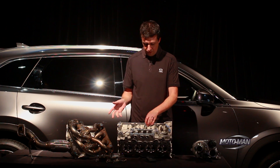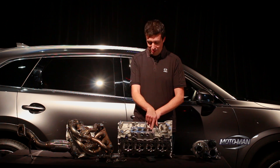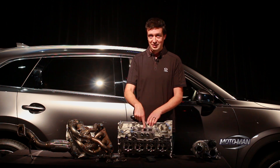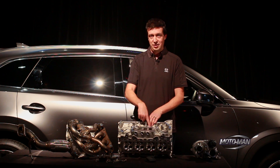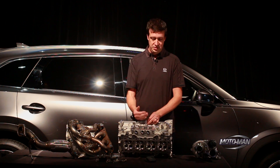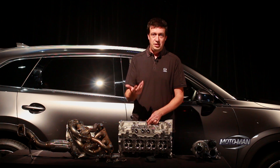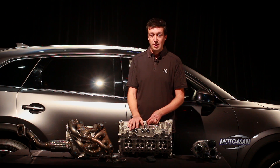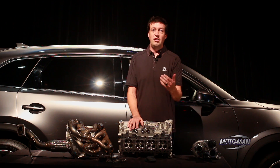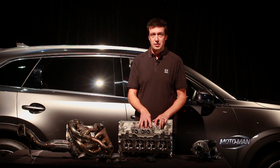By pairing the cylinders — numbers two and three together into one port — we're able to always have our high energy flow next to our low energy flow at every cycle. The firing order in a four-cylinder is 1, 3, 4, 2, and they're always next to each other, always going back and forth from outside cylinder to inside cylinder. So we always have our air and our paint right next to each other to use this airbrush effect to scavenge the exhaust. That lets us run a higher compression ratio — this is a 10.5 to 1 compression on a very high boost engine running over 15 pounds of boost right off idle. That's an impressive combination that could only be achieved through this kind of trickery.